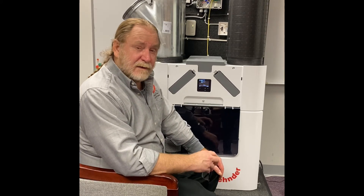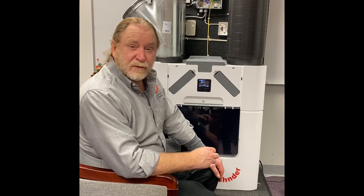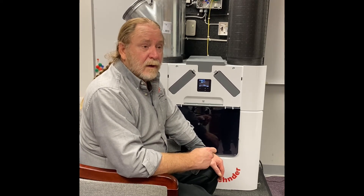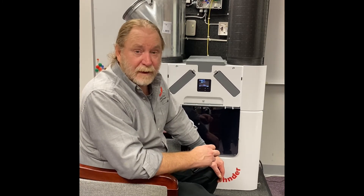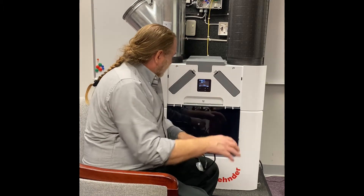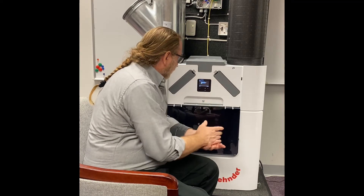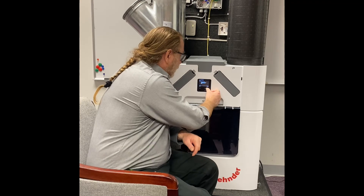If that flow is different, it means there were possibly some shortcuts taken in installation. If your max flows are compromised, it may mean that on the final commissioning you may not be able to reach all your numbers, but most likely you will be able to. We're going to confirm max flow preset three — measured max flow is 600, that's perfect. Confirm. Keep all valves completely open until instructed to fine tune the valves. Confirm.